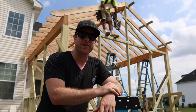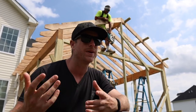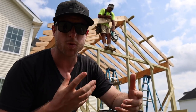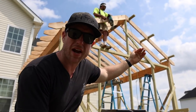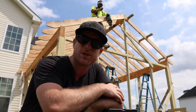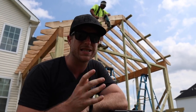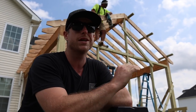Got Tony up here, he's cutting in our fly rafters, and that's basically just a decorative overhang that we're doing - they're not structural. He's cutting in these 2x4s, they're overhanging, and then we're basically going to nail a rake onto that. We're going to cut the same rafter but it's going to be out of 2x6 so it matches all of our other soffit trim, and it's going to be a nice little detail there.